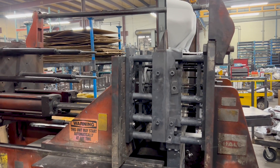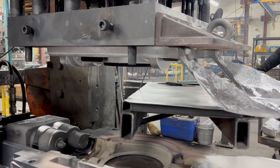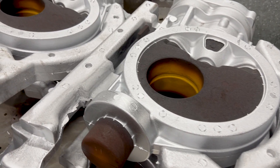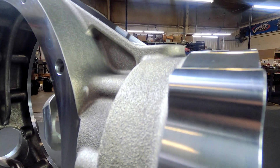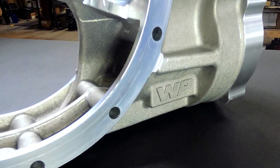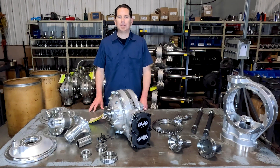We already released a more in-depth video explaining the permanent mold process, which we'll link down below. But the short version is that permanent mold casting uses purer base materials and a more controlled and repeatable process that produces castings with significantly better tensile strength, yield, and elongation properties than the sandcast centers currently on the market. We had these tested by an independent lab that determined that these are indeed the strongest production quick-change center sections available anywhere.